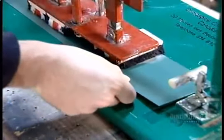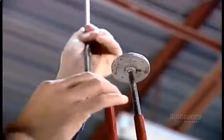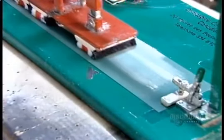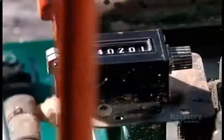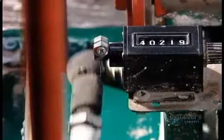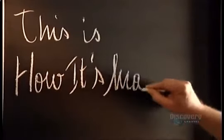The factory takes samples from the production line and subjects them to rigorous quality control testing. These tests ensure that the painted surface is glare-free and can withstand chemical solvents, extreme humidity, heavy impact, and hard scratches. A special machine conducts a durability test, applying 100,000 chalk and brush strokes. For the batch to make it to market, surface wear must amount to less than one one-hundredth of a millimeter. The paint finish must still be matte, chalk lines must be clear and dark enough, and writing must erase cleanly and easily.